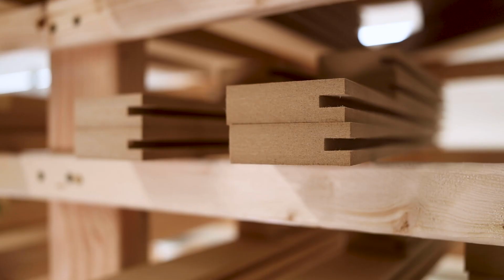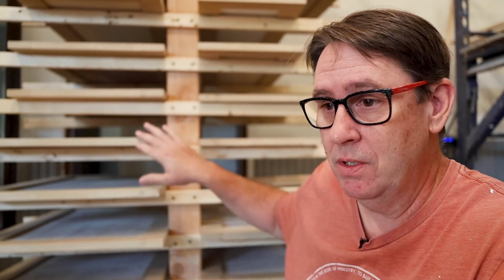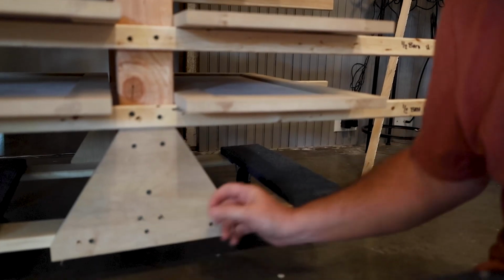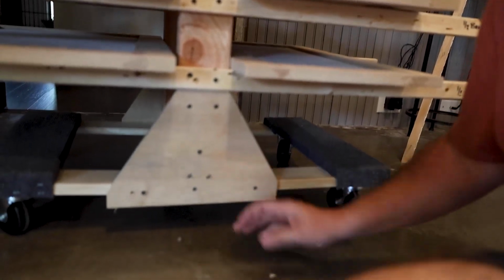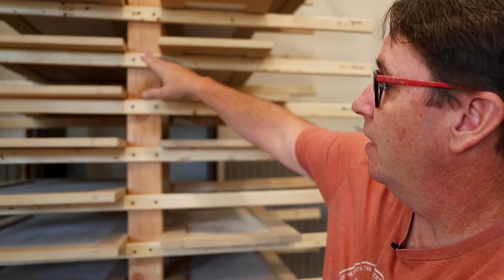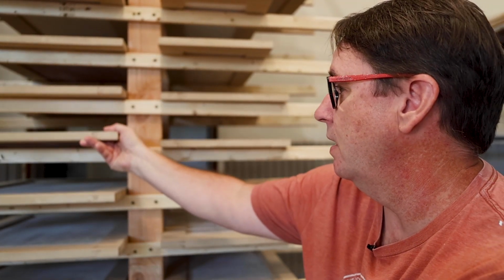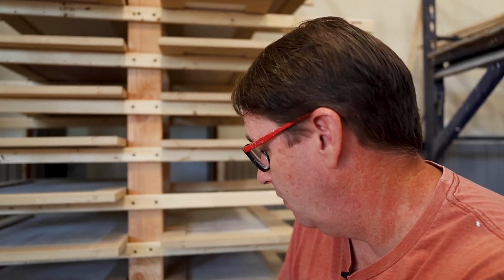In fact, I moved it into my den because this is where I'm going to have all of my doors and drawer faces drying. Since it's a controlled environment and my garage is not, and it's like 95 degrees out today. Anyway, that's your update. Like, here, see? Basically, I just unscrewed this and put this new dolly in place. I did level these off. I put a level on them, and they're spaced 3.5 inches apart, so I can get a door in here easily. That's my drying rack. We'll disassemble it once all the doors and drawers are done, but I gotta get to painting those things. That's for another video.